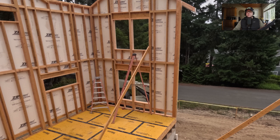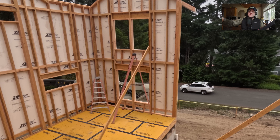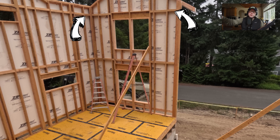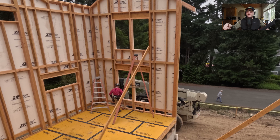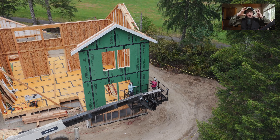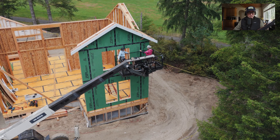Now, let's see where the ladder's at. That first row of blocking — that's our fire stop and panel edge blocking at the floor system. The one up above is at the ceiling system. And then we framed our walls taller, so that means we had to insulate those before we could cover it with a ledger. That is a future video. What we're going to do now is boom up to the top and lock all of that in. We'll see if we got it right.